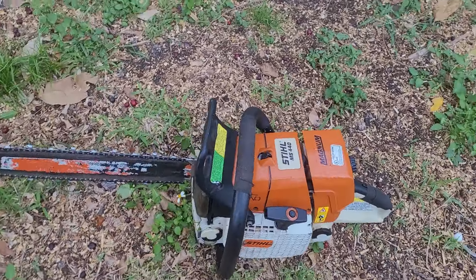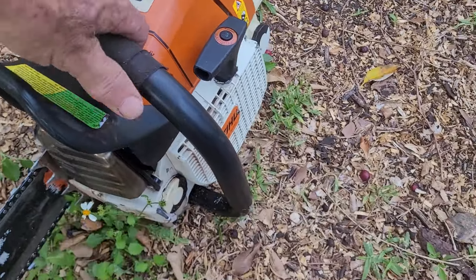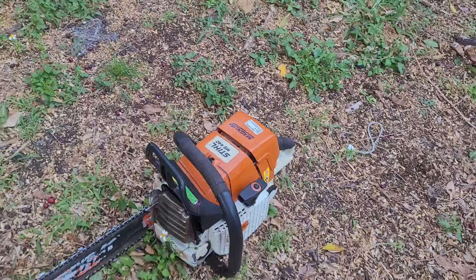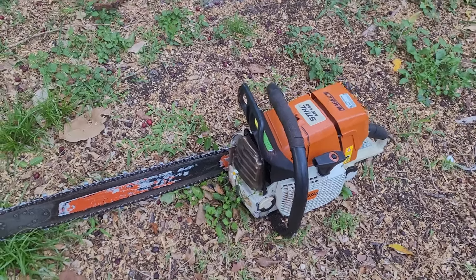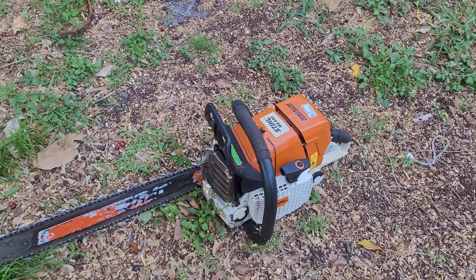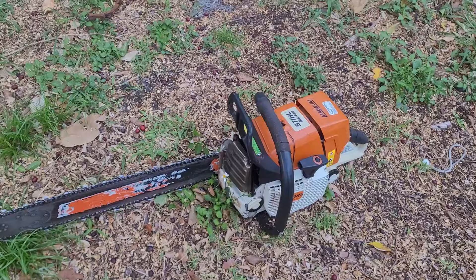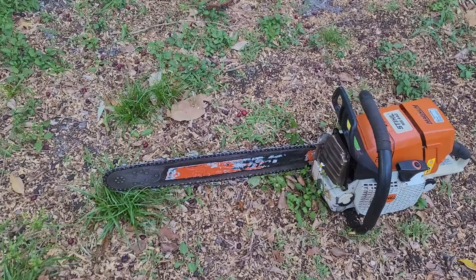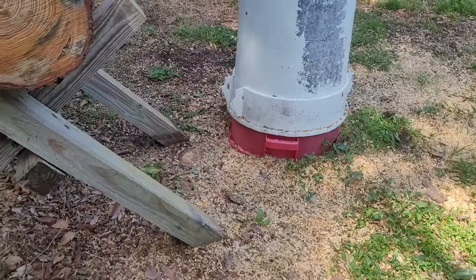This 440 with the 460 cylinders is running really nice too. This has a regular chain on it, a round ground. And this is a muffler that Mike gave me — he made a dual outlet, silver soldered it. I just put this baby on. And this is a cylinder he gave me too, a 460 cylinder that was just about perfect. I used a Meteor piston with two rings, a tapered pin, all that. I did some porting on the cylinder, just clean-up porting — I didn't change any port numbers. Gasket delete — I used the Ultra Permatex high elasticity, let it dry for 24 hours. Cleaned the carburetor. It's got the HD filter. This son of a bitch runs excellent — it pulls a 25-inch bar and chain really good. Not that I have that on there now; this is a 20-inch with a lightweight bar. I absolutely love these lightweight bars. Let's make one cut with this — kill two birds with one stone.